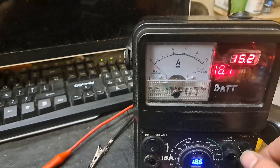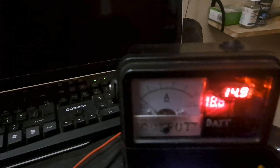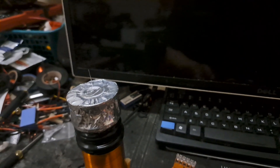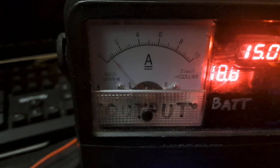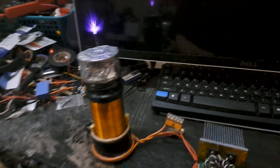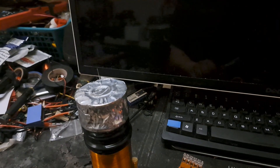I'm going to put it at more like 15 volts, just play around with the voltages. This one's not going to put out crazy long arcs or anything. Let me cut the lights down. About 15 volts, get that going. Pulling that CW is messing my phone up, but that CW pulled quite a bit from this supply. I need something that's like a good 10 to 15 amps probably. That's pulling the supply down to like 10 volts or something. And of course, I've got the higher frequency interrupter — that's like 13 kilohertz — which doesn't really drop the current draw a whole lot.